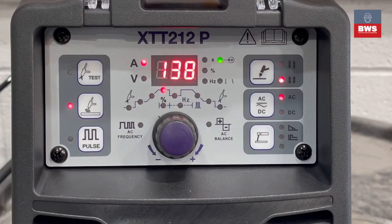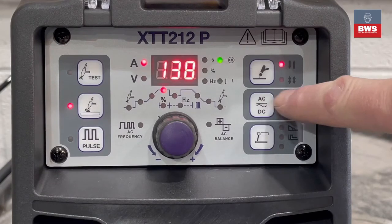The top right button is for the welding trigger. The top LED is trigger on/off and the bottom one is for trigger latch — use this when doing long welds. Press the trigger and release to start the weld, and press and release again to stop. Next is AC-DC: AC is for aluminium and DC is for ferrous materials.